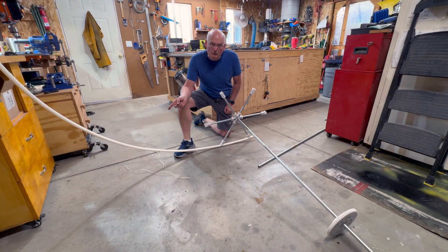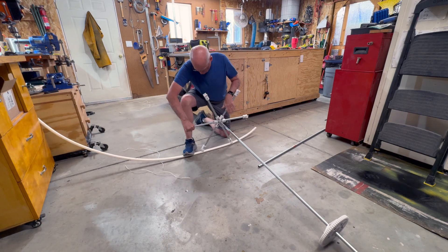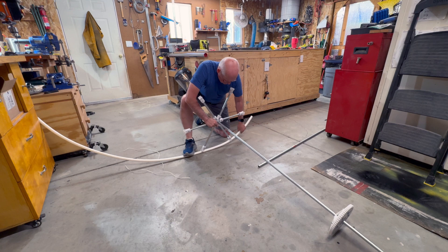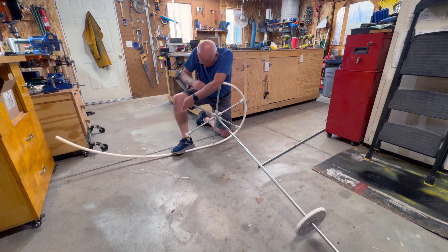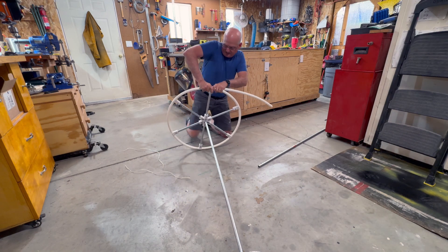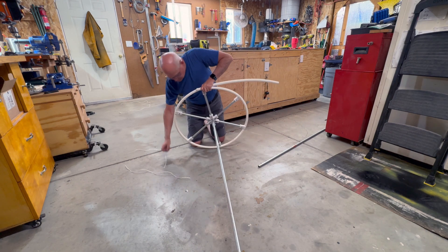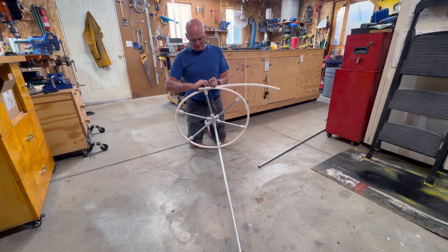For your PEX, I have three-quarter-inch PEX here purchased from Home Depot in 10-foot straight sections. It's a little harder to work with than the coiled roll version, which I believe comes in 100-foot sections. I'm just going to kind of roll it around — I did a little bit of pre-bending on it ahead of time. I got myself some twine to hold it in position. Once I've done that, I'm going to hit it with a heat gun to get the PEX pipe to hold its shape.